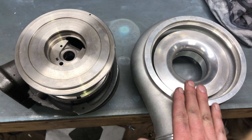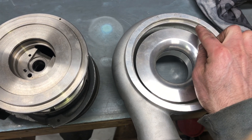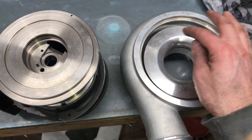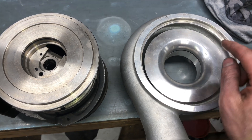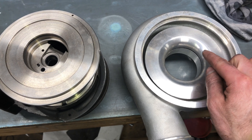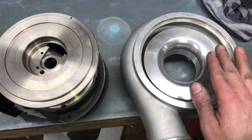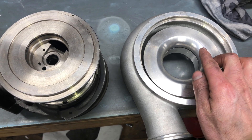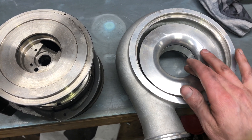To make this fit on here, if it's even possible at all, you're going to have to make an adapter plate that goes from here down to about 5 inches in diameter. You're going to have to have the correct spacing so you can fit the clip in here to hold that plate in, and also a clip here to hold the bearing housing into that plate.